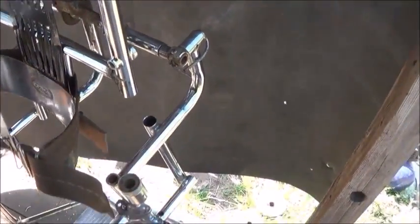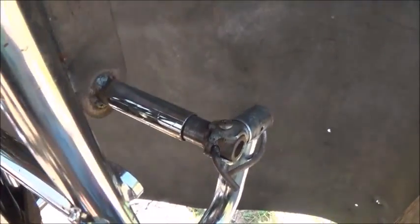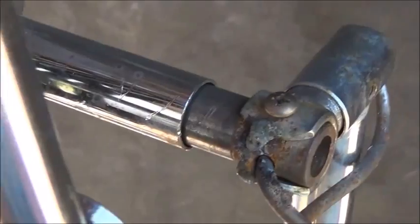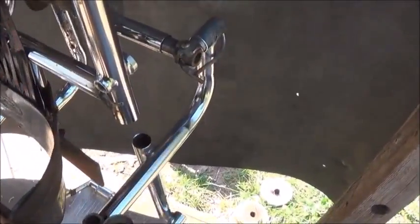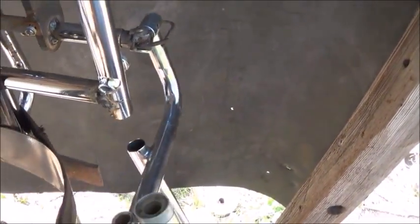The actual metallic hip here — you'll notice I've got a pipe inside of a pipe there and it swings. If I zoom in for you, you should be able to see which one's rotating and which one's not. So that's one way of rotation — that gives us our back and forth. Now to compensate for that, right here we have another directional pivot point. You can see there's another directional pivot right there.